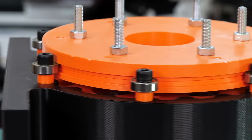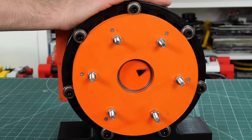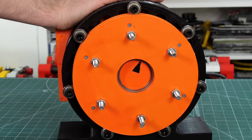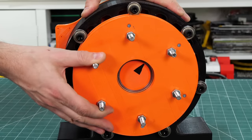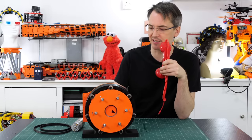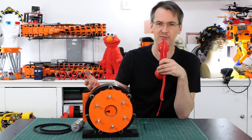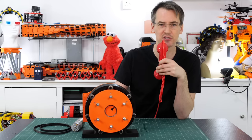So that's my poor man's big bearing — made with lots of small bearings. I put a little black arrow on the cam so you can see it turning, and then you can see the outside going around much slower — 20 to 1 reduction. There's a little bit of backlash, probably 10 degrees or so, but actually pretty good for something so big and crude. It's a bit mysterious that this is running really smoothly considering the last attempt where those cycloidal discs were flexing the casing — I think it was just the motor mounting that wasn't optimal. I've used the same CAD and haven't re-toleranced the parts, only changed the mountings, so I'm really happy with how this is running.